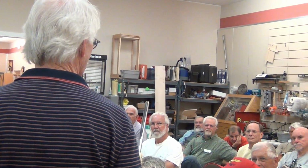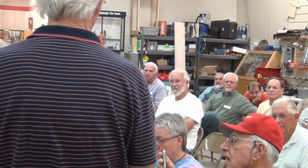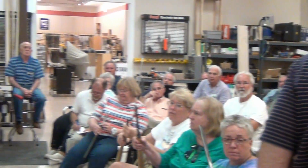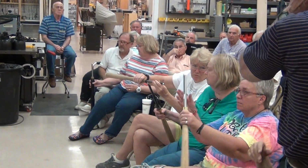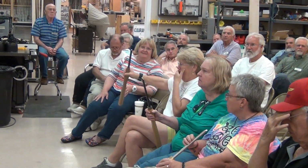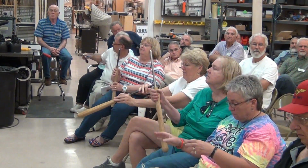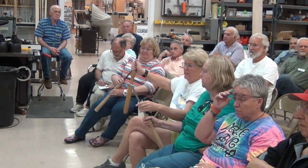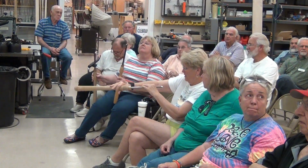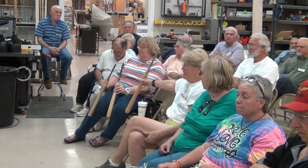And the last one is the newest one I just got, which is a one-way. And it's probably the most significant difference when you look right down the flute, the one-way versus the others. They told me it was V, and I probably should have sent it back. They told me it was parabolic, and I should have sent it back and said, that's not parabolic, it's U. But we'll see. I really am a believer, as other people talked about, of repeatability, muscle memory. So if you're getting the same steel and you're grinding it with the same jig and everything else, your muscles are going to learn. And then I started thinking, well, yeah, but you don't always have your tools and you're not always with your jig and all that sort of stuff. So it's probably not a bad idea to have a little bit of flexibility.